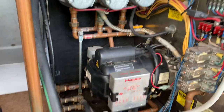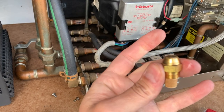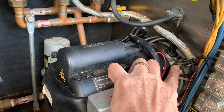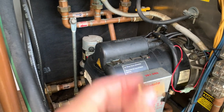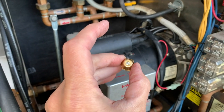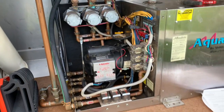Hope this helps you guys. I'll show you a picture after it's all put back together. I wanted to show you why I've got everything apart — usually what goes out is the fuel tip, and they're only about 10 bucks depending on where you get them. They go inside this unit. You loosen this bolt, there's one on the other side, you flip these up, the whole thing pulls straight out, then you tilt it up and use two wrenches to pull it out and stick another one in. I've only had this for four months and I've had two of these clog up — just bad fuel. But just thought I'd show you why this is open.